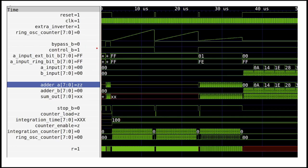We have five different tests running. The bypass loop gives the highest counter value because the ring oscillates fastest. The control loop adds four extra inverters so it counts a bit slower. The adder loop adds the biggest delay and gives the lowest count. The final part of the test is a constrained random test to check that the adder is actually working correctly.